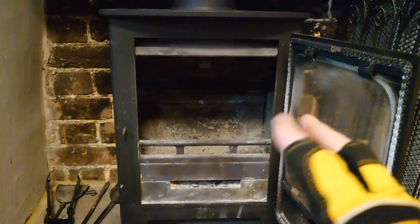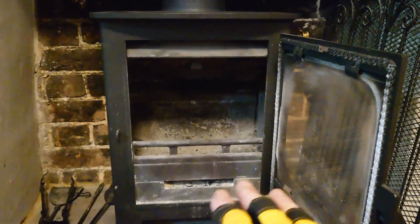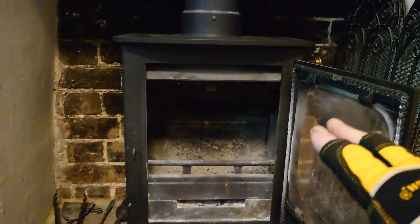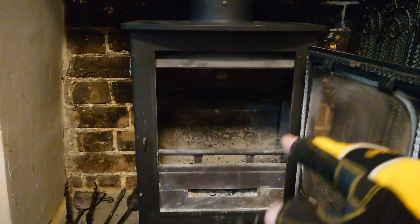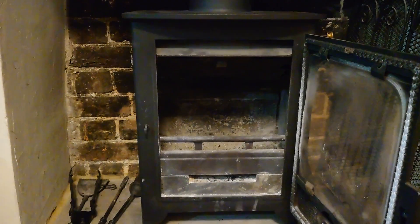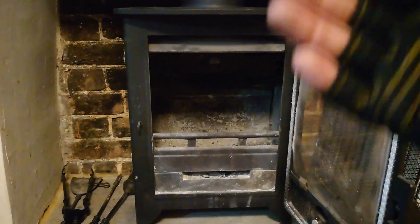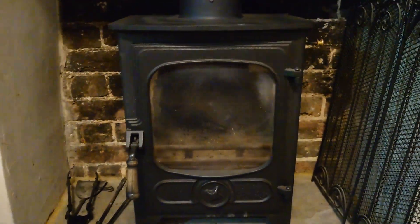The customer wants me to leave it in there, so that's why I've made sure there's enough air to go in the middle. When you compress down the ash it goes hard, and if you've seen my other videos you'll know that - with a multi-fuel stove, when it goes rock hard on top of the grate it won't go through the grate. Some of them you can close the grates off and empty the ash tray out, and the ash will stay in position, so there'll be enough clearance for the air to circulate. I just wanted to address that because I've had a lot of questions about airflow recently.